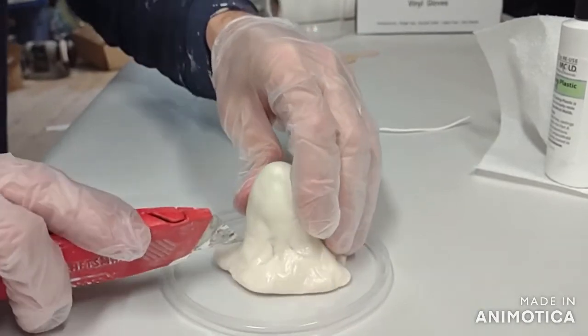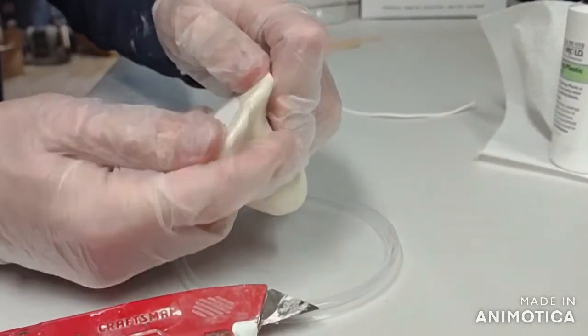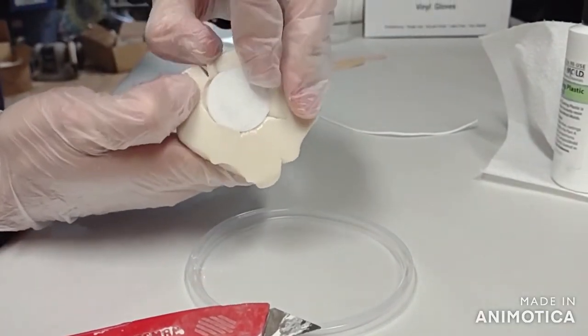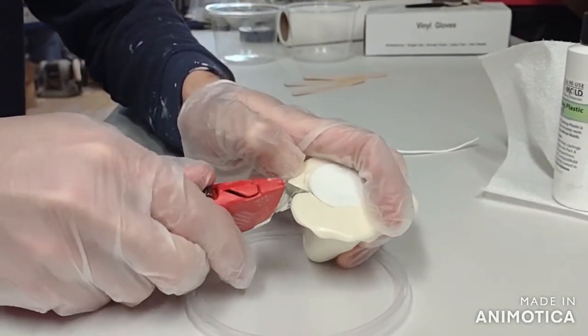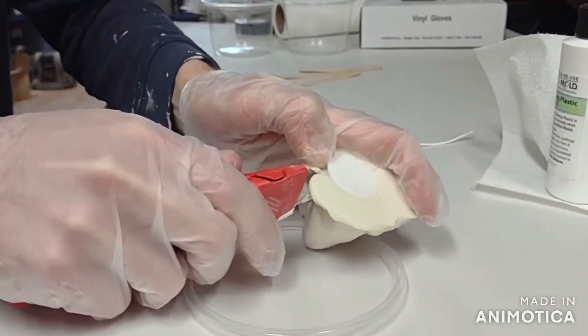After cooling it to solidify, pull out your original and you're ready to make your duplicate. For longer or more complex parts like this Dungeons & Dragons bandit figurine, cut down the side with any knife to pull out the original master shape. Try to put the cut down the side of the mold, and in this case not over the front of their face. This cut will be your parting line.